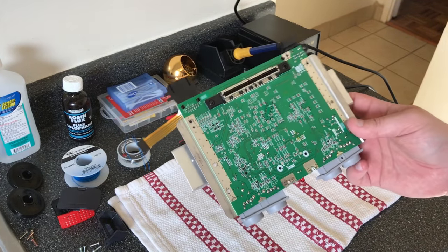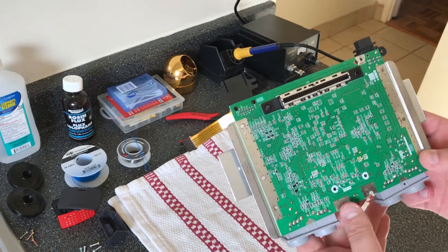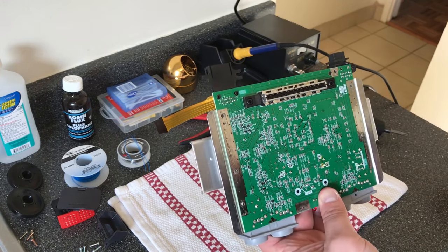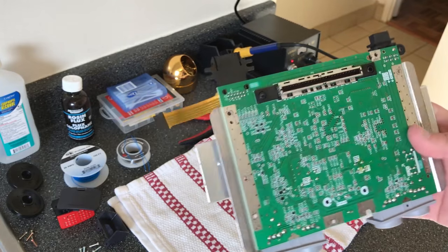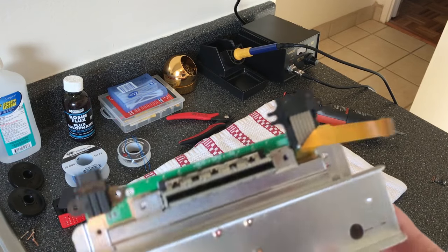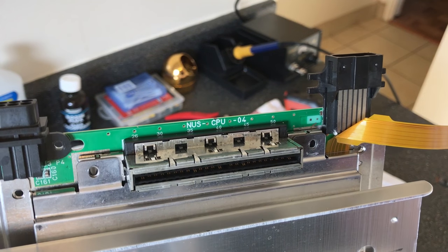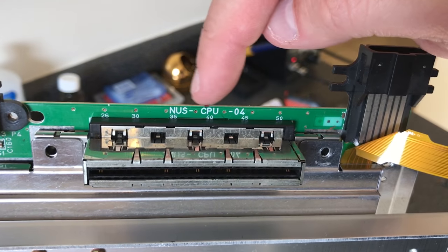Before we go any further, I just need to talk really quickly about sync. If you're using a sync on Luma cable, or if you're using one of the older revision boards that doesn't have any sync stripper built in, then this doesn't apply to you at all, and just fast forward about a minute. But if you need to use a sync stripper, or if you're using a RGB cable that gets sync off of the C-Sync pin 3, you need to worry about which revision motherboard